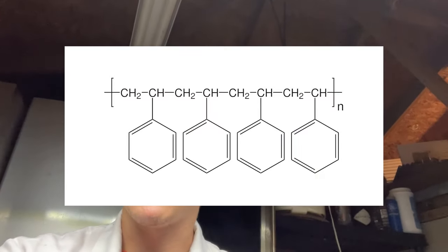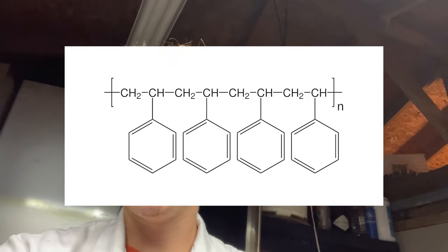What is going on in our pyrolysis of polystyrene? Here's our molecule of polystyrene. Under high temperature and without an oxygen atmosphere, our polystyrene is going to begin to break apart. Without oxygen, it's not going to burn — and this is a good thing because if it burns it's just going to turn to CO2 and water vapor. For the most part under this high temperature, the bonds between the aromatic rings are going to break apart first, because aromatic rings are resonance stabilized and much more stable compared to the linkages between them.